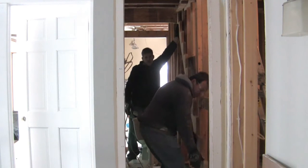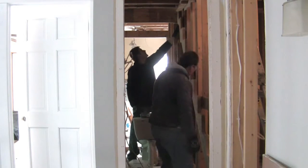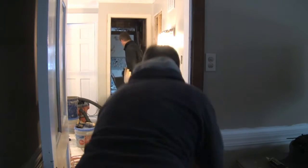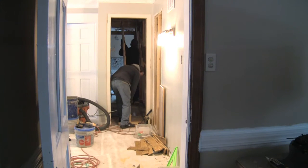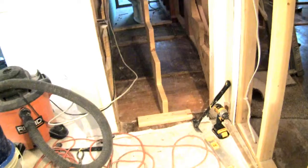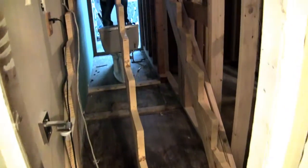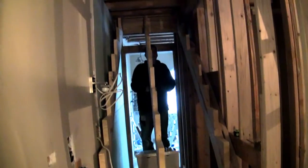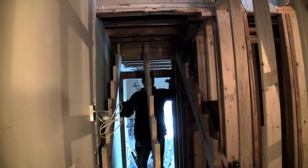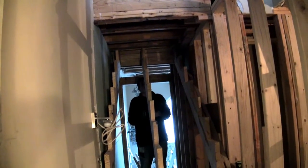Yours should go inside that drywall area there. Yeah. Yep. All right, now we've got our 3 stringers in. And what adjustments have you been making? Well, I brought the stringers out away from that wall so that they're 16 on center, because we opted for a wider hallway.